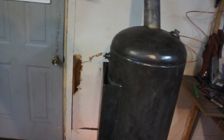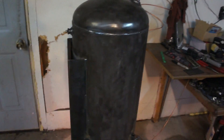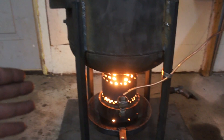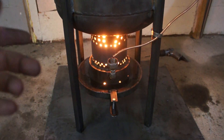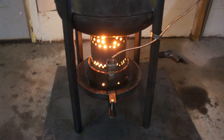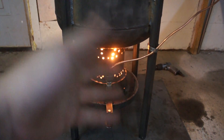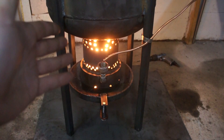It's ridiculously hot. This is our cold air intake and it's reading 89°F right by it. The flue dampener idea does not work at all — it just screws everything. Quarter-inch fuel line is too small; it works at the lower settings, but if you want to get everything you can out of this heater you'd need to go to the 6-inch chimney and a much larger fuel line. Quarter inch does not cut it.